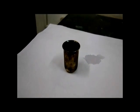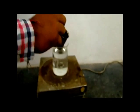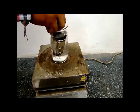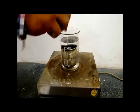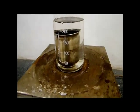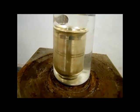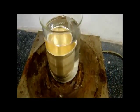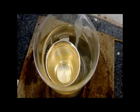Cleaning is performed by dipping tarnished silver in hot cleaning solution for 15 minutes, followed by washing in water. The cleaning chemical reacts with the black layer of silver sulphide, converting it back to silver. Therefore, metal loss during cleaning is negligible even if silver items remain in solution for several hours.